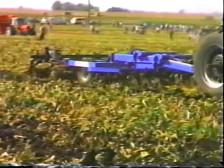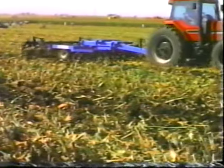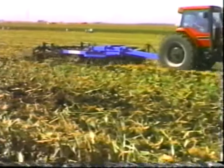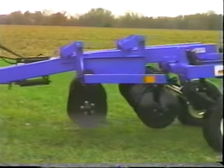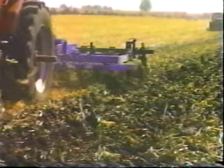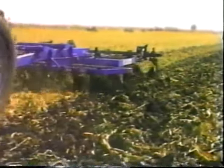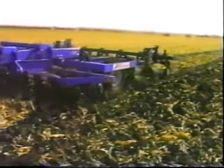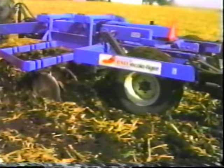The Ecolo Tiger Model 527 was designed for the two-wheel and front assist tractors in the 130 to 180 drawbar horsepower range. Two rows of 20-inch disc blades are mounted individually on a rectangular frame to cut outward and then inward to size, mix, and level the soil. The residue is left uniformly incorporated in the upper 2 to 3 inches.